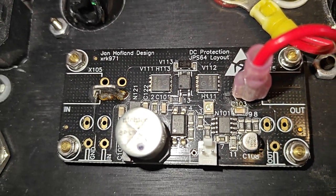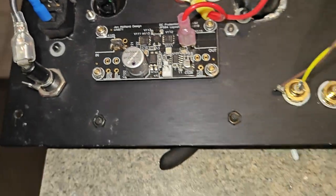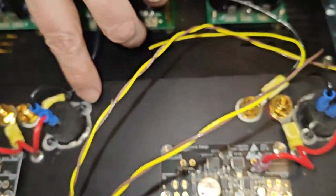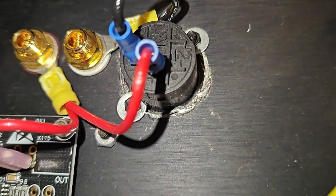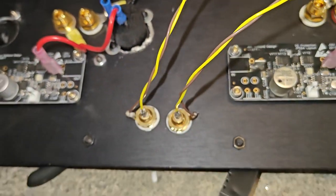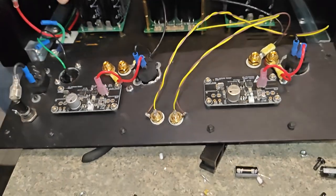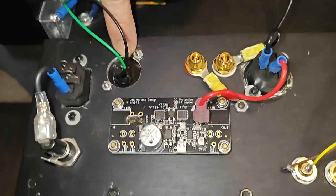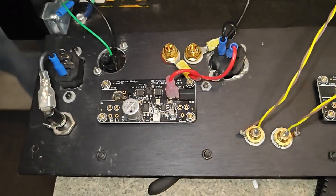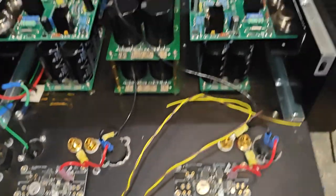This being one of the earlier amps, I had not yet discovered the 24 millimeter hole punch, so you'll notice these are terrible, ugly, horrible holes here with washers that kind of just jimmy everything in. But this one particular hole for the 12 volt trigger — which is one of the features that the Neurochrome intelligent soft start provides — that's a beautiful looking hole because I've got the right tool for the job now.